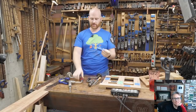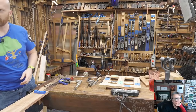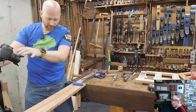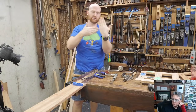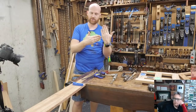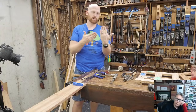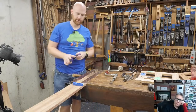We're going to use a Kreg jig with a brace — yes, you can do that. Alex asked: does pocket joinery need glue? If you're gluing end-grain boards like we'll be doing tonight, glue is not going to do much. You need a compression fit for glue to dry, and in an end-grain application most glues won't hold. They'll break out pretty easily. So putting glue in there will help a little bit, but it won't help worth anything in the long run. Generally, no.